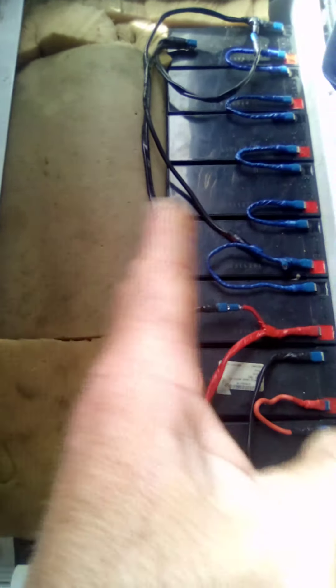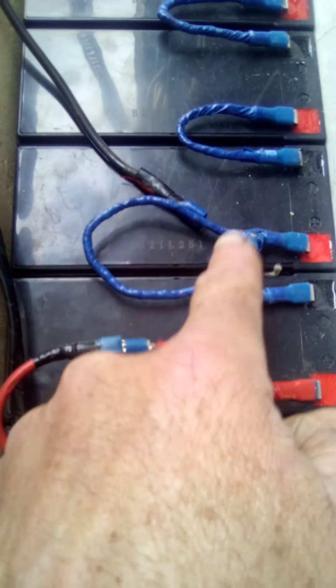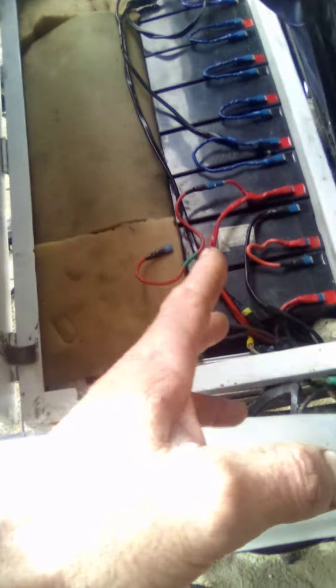Half of the batteries have been taken out for the other alternator low-rider bike until I can buy another six more — they're $50 each, 12-volt 9 amp-hour batteries. They're all in series; the two here power up the mag on a separate on/off switch. I put a DC controller between that — a 350-watt one at 24 volts — and instead of a throttle I used a volume control, which worked out really well. We've already got a world record on this; it topped out at about 70 km/h.